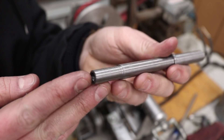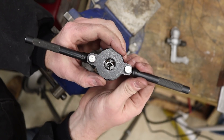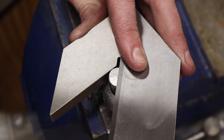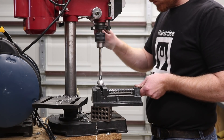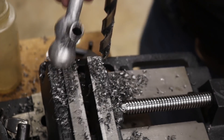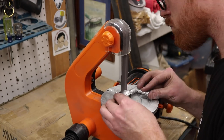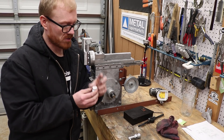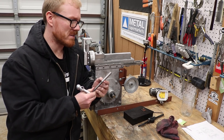The diameter that I selected is partly to help guide the die that I'll be using to cut threads in the threaded portion of the downfeed screw. On the other end, the diameter was selected to correspond to a ball crank that I had cast a couple years back during the lathe project. Back at that time, I didn't have the benefit of the experience I had on my recent video on the Shaper Protractor disc where I learned that a taper makes the arbor a lot easier to drive out. I also didn't have a lathe at that point, so there would have been no way to turn the taper. Long story short, I had to drill out the arbor and then drive it out of this ball crank. Then I took it over to my sander and cleaned it up.